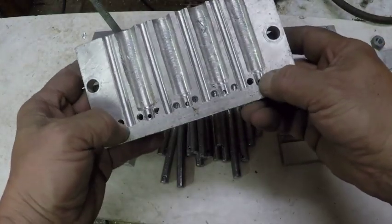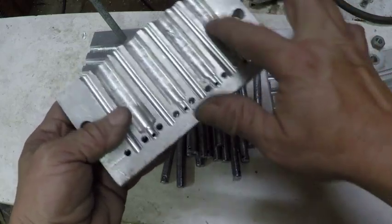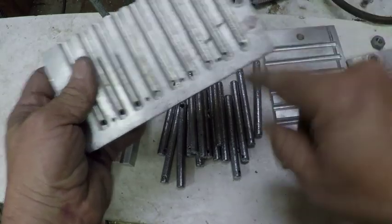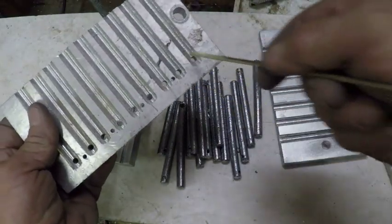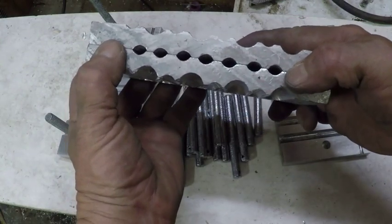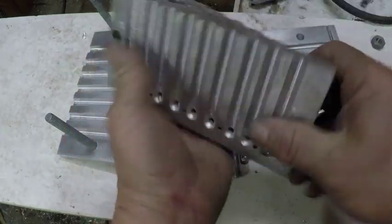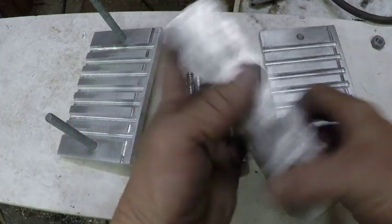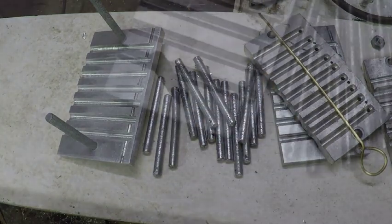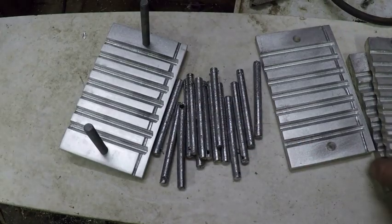If you look at this mold I made, you'll notice I used a smaller bit first, drilled it all the way down - that way it makes it smaller on the tip and makes it where most swivels will hook right through it. This one is four ounces, and if you flip it over on the back side these are two ounces. I just cut them in smaller pieces and stick one through each hole. When I'm making the two ounces, you'll notice they're oblong because I put the spacer in but never drilled them out round. When you want to make bigger ones, just flip your mold to the other side and you can pour your big four ounces. Hopefully that video will help you out. I appreciate you watching. If you enjoyed it, please push the subscribe button and ring that bell - every time I post a new video of fishing or how-to, you'll be notified.